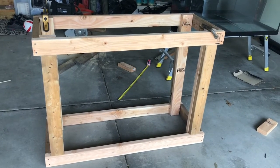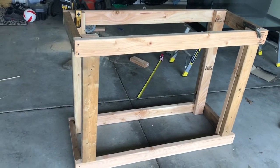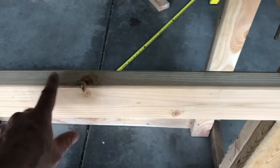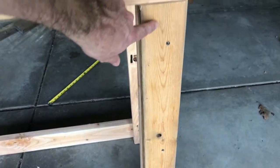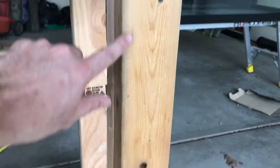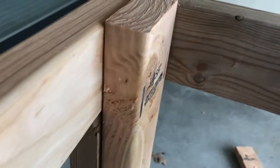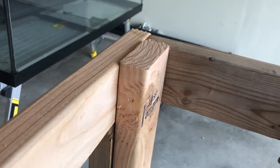Got the stand dry-set — I haven't put any screws into the top and bottom rails yet; I just wanted to give a little demonstration of how it's going to fit together. Got a couple of temporary clamps here. You can see this is my top rail and then the bottom rail. My design is that these vertical supports at the four corners are holding up all the force. And these inside ones, you can see, are really just holding the frame to the supports — they're not meant to support any load.